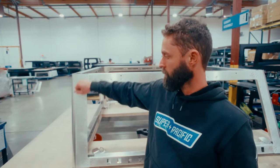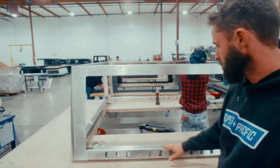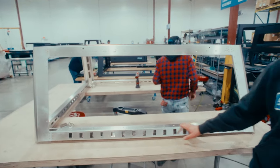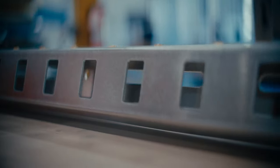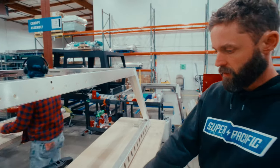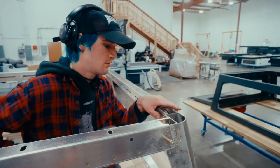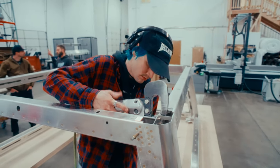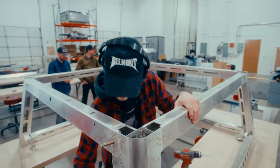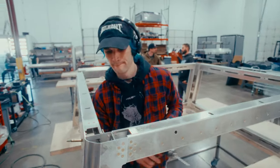Those are taped and then riveted down. And then at the box beams where we don't need to countersink them, we leave the button heads. These little knockouts let the riveter get in there and squeeze the rivet. And they shave a little bit of weight, but mostly they just give us access to where we need it. And Max is setting up to put the brace in the inside corner. It kind of ties the whole thing together and knocks out any looseness in the assembly.